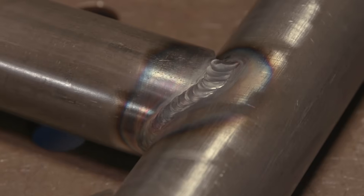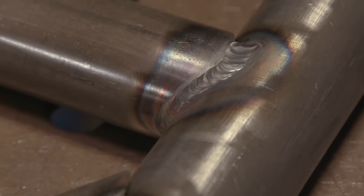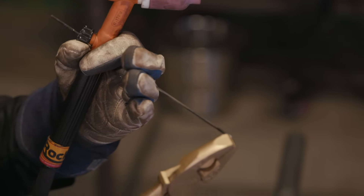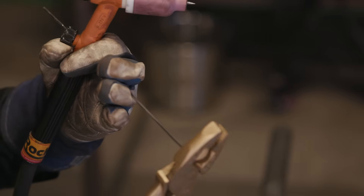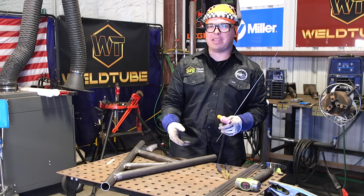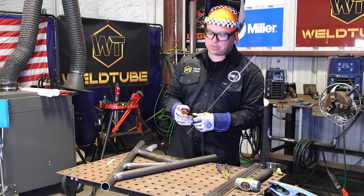You want the profile to be very low, very smooth, very flat — that'll help with the strength of the weld. Very important: every time you stop, clip the end of that wire in case you got it contaminated. You don't want to restart and start getting trash in that weld. That could be really hard, especially in these tight areas where you can't clean it up, can't get a grinder in there. You start contaminating it, you're just going to make things a whole lot worse.